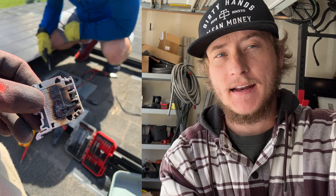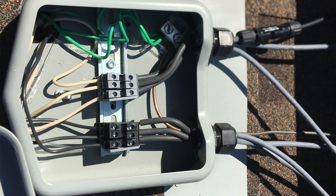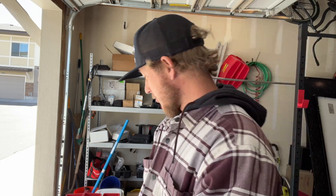It's usually a bad connection inside the junction box. There are a lot of different things that solar installers use when terminating conductors on the roof. Terminal blocks on a DIN rail, wire nuts, and Wagos — those are the three most common. There are other items out there that might even be better, but those three are the ones I see.